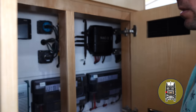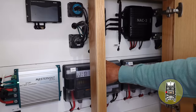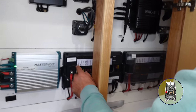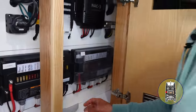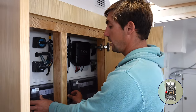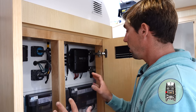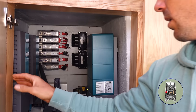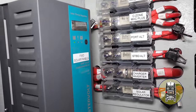This is the heart — or maybe the veins — of the electrical system. We have our NMEA backbone, our autopilot controller, our DC-to-DC charger, and then all the C-Zone fuse block. Like I said before, if the display ever failed and you wanted to turn on your B&G autopilot, you just pop out a blade fuse, put it in the slot right above it, and manually override the digital switching to get anything you need to work. That redundancy was really important to me when we were deciding whether to have C-Zone on our boat — glad we have it. In this cabinet, we have our charger inverter, two MPPT solar controllers, our Starlink, and just a bunch of fuses and another fuse block down there.